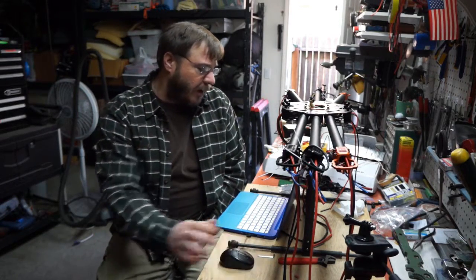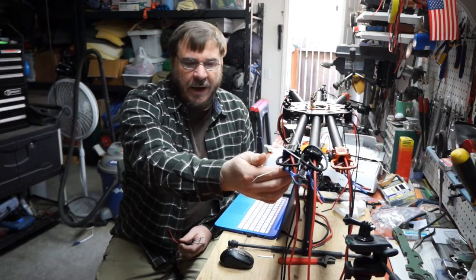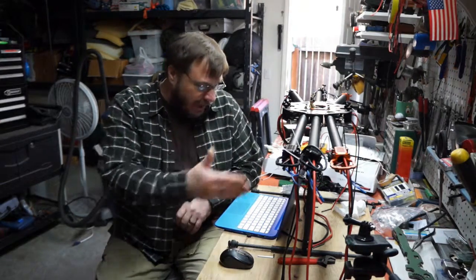Here to talk about the long wire ESC problem that everybody talks about on the internet and why you need to add extra capacitors on the inlet side of your ESCs because of inductance. When I was specking out this multi-rotor, I was buying everything and it said you may want to buy these extra capacitor packs for your ESCs because long wire ESCs have a problem from inductance. So I started looking and there was literally a 67-page thread on RC Groups talking about this problem.